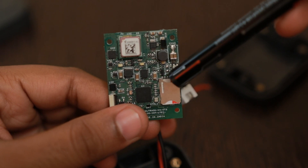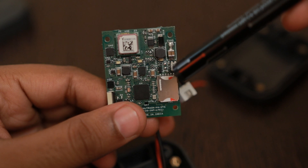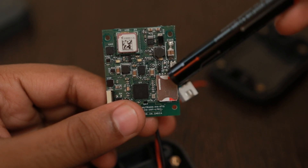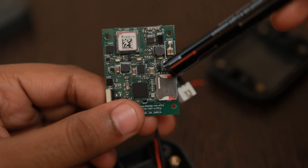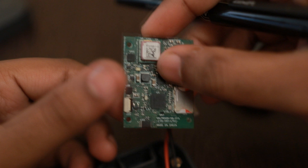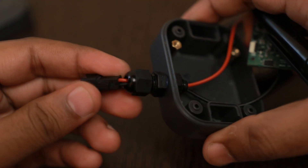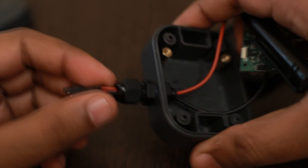We added two pads here as an auxiliary output. If someone wants to control the ignition remotely, we can use this MOSFET driver to control a relay connected to these pads. We can draw out this MOSFET driver output through the cable gland — there is enough space here for one more wire, and ground is already present.